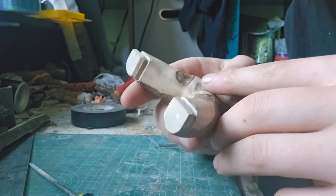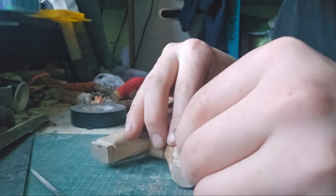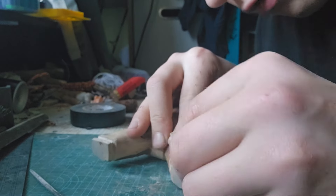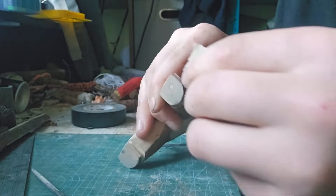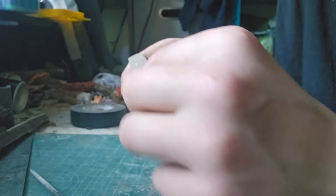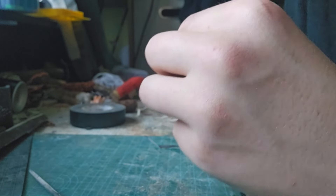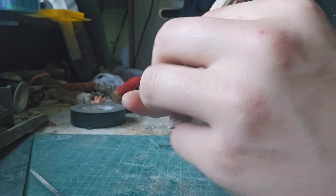We've got our band grooves in all the way around. As you can see there's a bit of a burr — it's quite sharp. Fine 180 sandpaper, just run it out a little bit wider than those grooves all the way around. All that does is remove the burr and ever so slightly round them — just enough that you won't go cutting your bands.